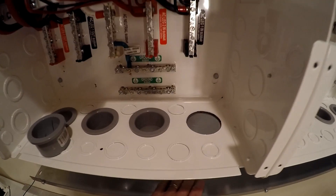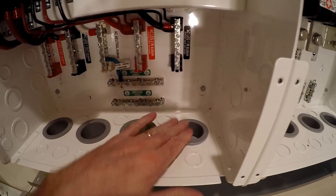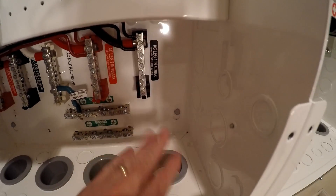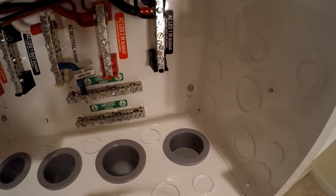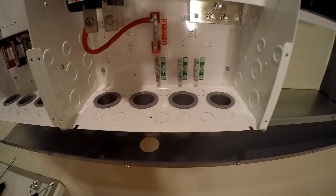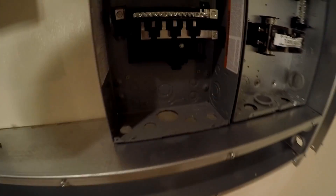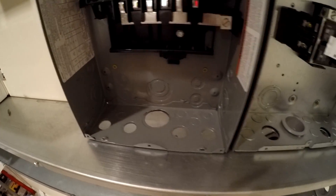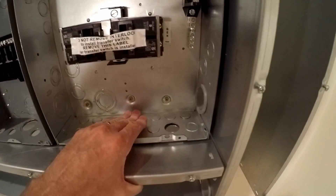There's the knockouts and then the hole punches through the cable trays, and I've got these little inserts I'm putting in here. So in case there's any rough metal edge, this makes a nice plastic — it's isolated. I've got all these in here, there's four more, still got a couple more I've got to pop in. Got to get all these sizes right, but got them all. All the holes are cut through, they line up pretty good — not perfect, but they'll be good enough to pop all these in.